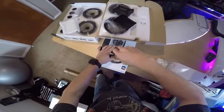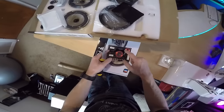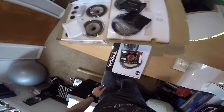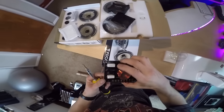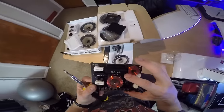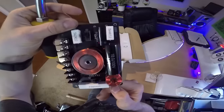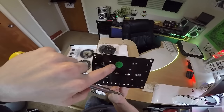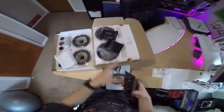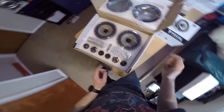I won't try and guess at what all this other stuff in the crossover does, but we've got three horizontal coils here, a couple of vertical coils, and then three big — actually my bad, these big things are capacitors. These two are coils, and the white things are resistors, but these lying-down cylinders are capacitors. Generally from experience, the resistors are to do with the tweeter and the coils are to do with the woofer, but I could definitely be wrong. It says up in the top corner PS165FX, and there's the model number for the crossover on its own down here — KIFI1079. QC passed 2015. So that's the look at the inside of the crossover. I'll quickly chuck it back together now, and put it in its nice protective little sleeping bag.